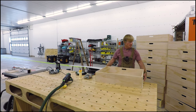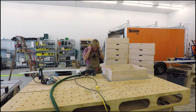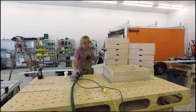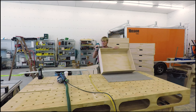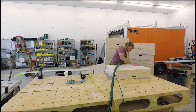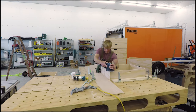There you have it — 20 assembled. Then I changed operations and went to sanding and routing the detailing. I started with a sanding router pad but after a couple of drawers, fighting the movement, I started clamping them down with a long clamp on each side. That was taking too long, so I ended up clamping a couple pieces of scrap plywood to the bench to trap the box, then flipped it and did the bottoms and top edges. That's the kind of thing you learn as you move through the work.